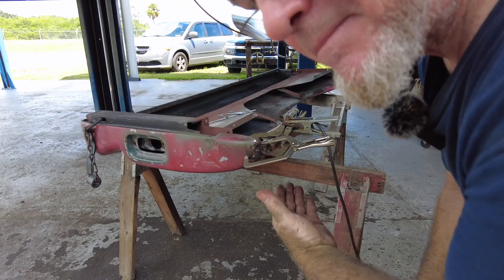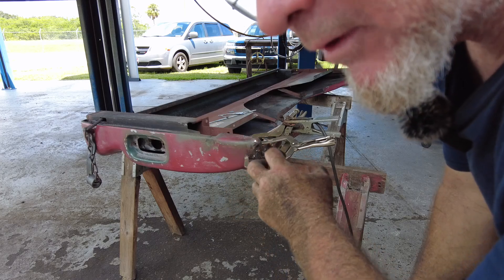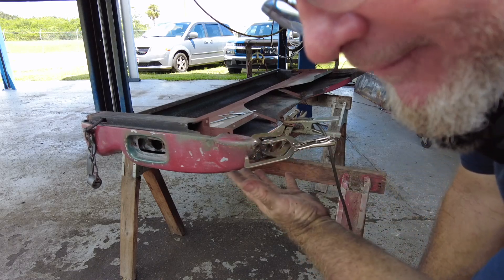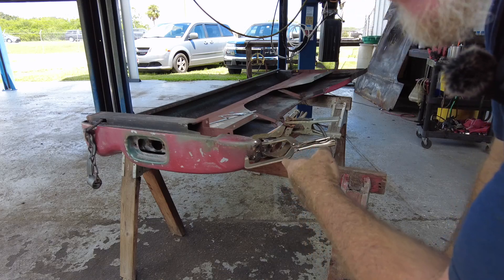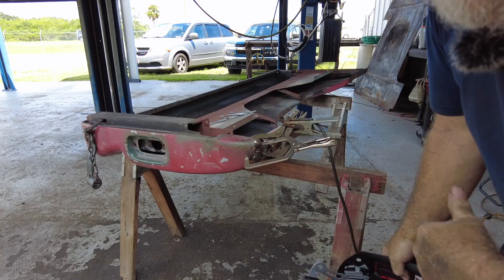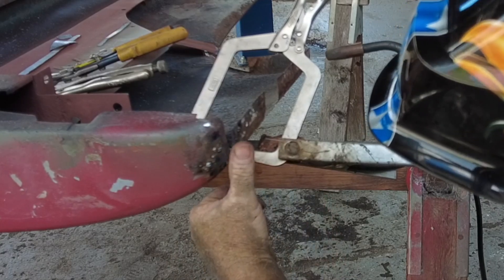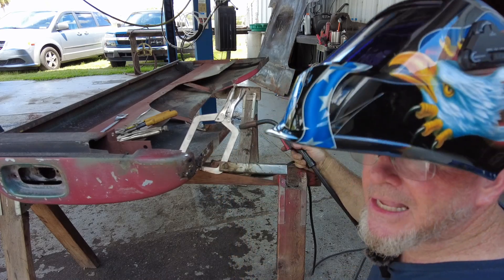Essentially what I'm doing is think of it like a spot weld — you have two panels together, spot welding the panel behind it. Just filling the weld, filling the rust hole. I ground out the really soft stuff and I'm using the back panel to fill the rust hole. If I had fabricated that panel properly it would've taken maybe two to three hours; I did it in about five to ten minutes. Got a couple more to do, then I need to make a panel for the little bottom edge. Once that wheel well panel arrives, we should be done.